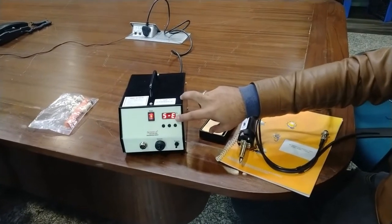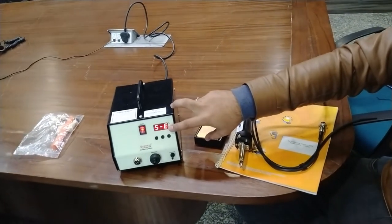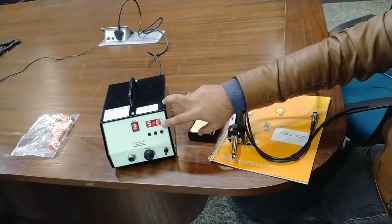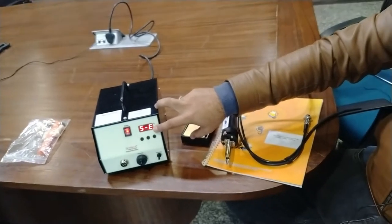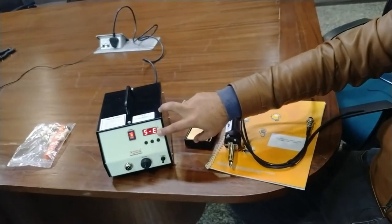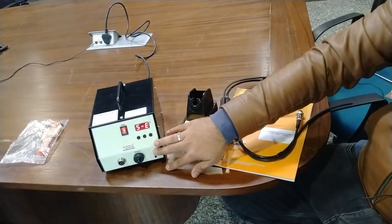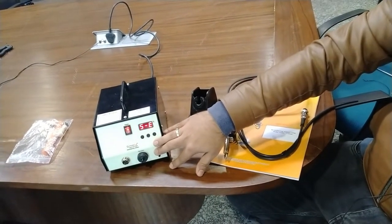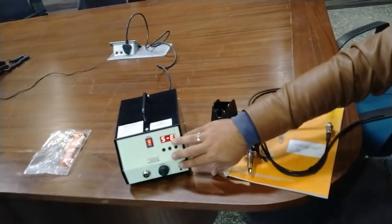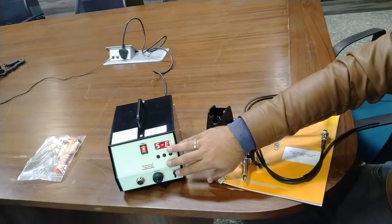This desoldering station has a 70 watt power consumption with 24 volt AC power supply. The desoldering output voltage is 24 volt AC at 65 watts. The temperature range can be set from 180 degrees centigrade to 480 degrees centigrade, with a temperature setting resolution of plus or minus 1 degree and accuracy of plus or minus 2 percent. The built-in vacuum pump runs at 4000 RPM and can provide up to 600 mmHg vacuum and pressure. The tip leakage current is less than 2 milliamperes and tip-to-ground resistance is less than 2 ohms.